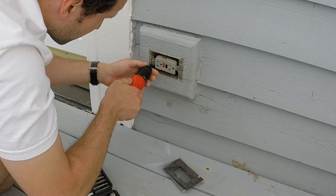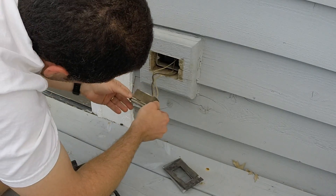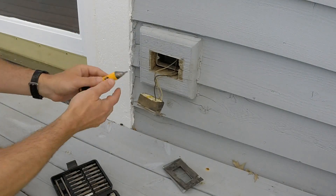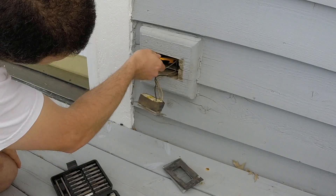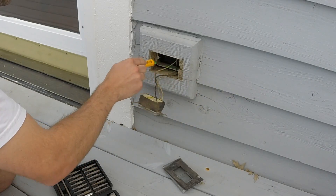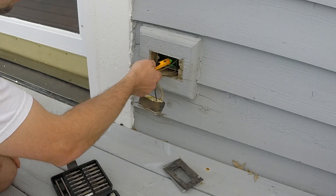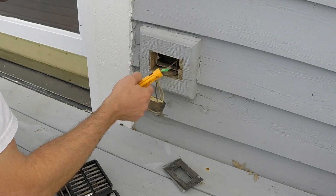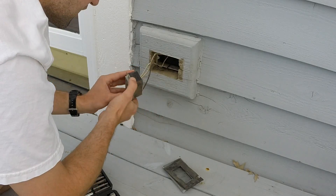Next, we take off these other screws here. As a precaution, I like to use a little scanning tool and run it inside the box just to double check that everything's off. Sometimes this circuit might be off but there might be others running through, because we might be using this box as a hopping point to another one. This is just so I know there may be something back there, but in most cases when I've seen other live circuits running through the box, even though this is off, you don't have to worry too much, but it's good to know. Okay, that's off — I'm going to go ahead and take off this tape.